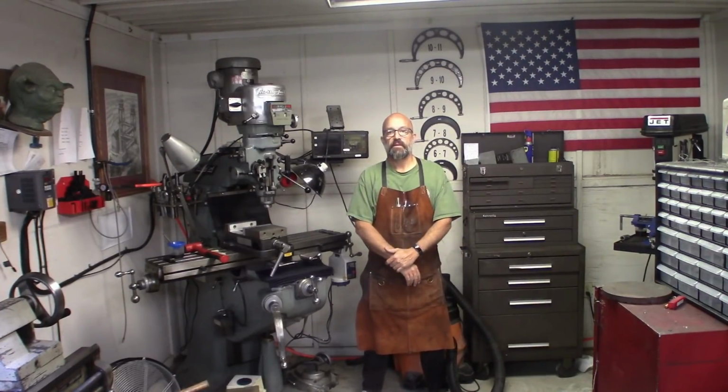On that note, I'm building a rotary phase converter, a bit larger than I originally wanted. I was looking for around 15 horsepower, something big enough to start the machine. At some point I'll probably remove the variable frequency drive and run this off a three-phase normally. But until then I wanted to have a rotary phase converter mainly to power the bandsaw.